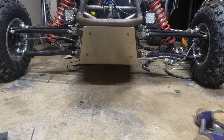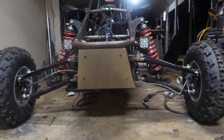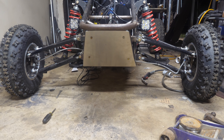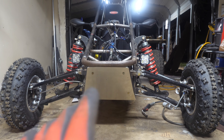That is the low setting on the front suspension. Let me show you what the high setting looks like. That is the high suspension lift — it did actually lift it quite a bit. I think it's around six to seven inches, which is really good. We're gonna go ahead and weld the strut towers up and then start working on the hood.